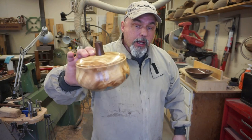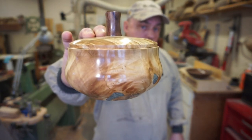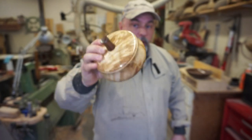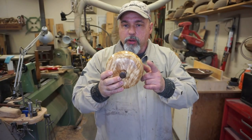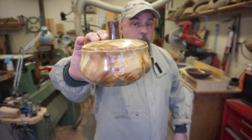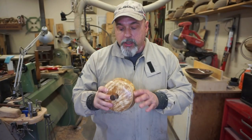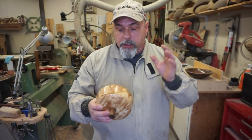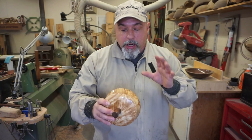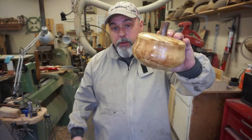And again, I really think that, you know, the wood bowl finish is a great finish, but in this case, this would be a lot more yellowy if we had to just put it on, and it probably would take about four coats of finish on that. So you know what, I think that doing the sanding sealer, the abrasive paste, and then the finish certainly is good in that regard. So anyway, let me know what you think about that.